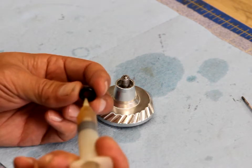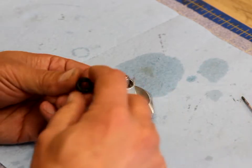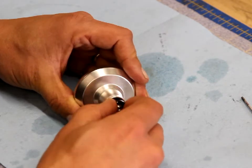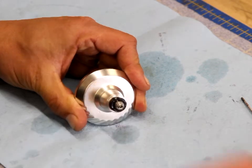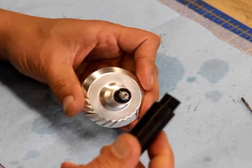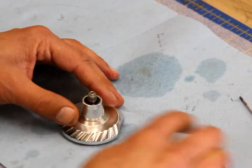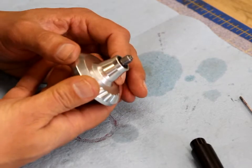Now I'm ready to install a new cover seal over the shaft of the main gear. Before I do that, I'm going to take a couple of drops of oil and put it on the inside of the seal. Then I'm going to rotate this seal along the threads of the shaft until it comes in contact with the body itself and can't go anymore. Then I'll take the other end of the seal tool and press the seal down, rotating slightly, until that seal is flush with the housing.